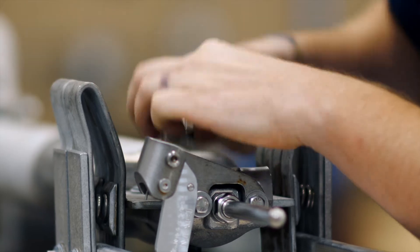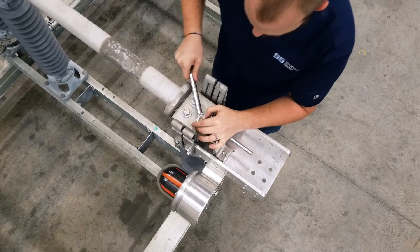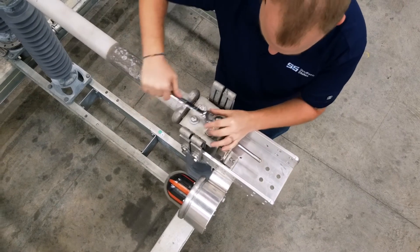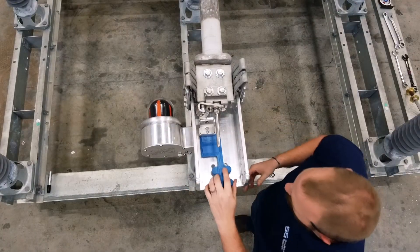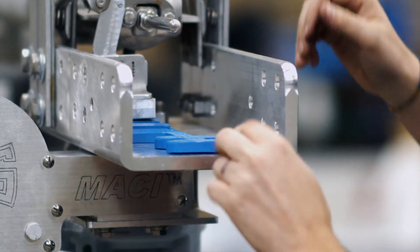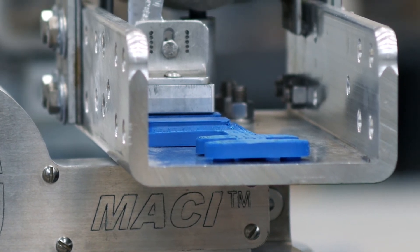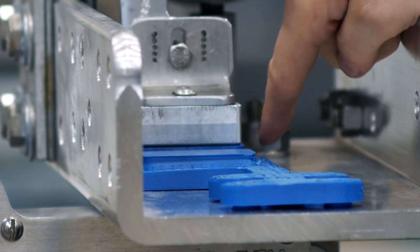Make sure to remove any unnecessary tools and equipment from your workspace prior to proceeding. As part of the MACY installation package, an alignment tool will be provided. This is to be secured in the four-hole NEMA pad located in the switch jaw. The switch arm magnet will be offset relative to the alignment tool and have an approximate 1/16th inch gap.